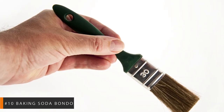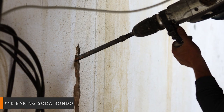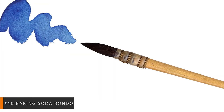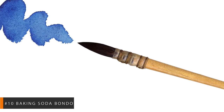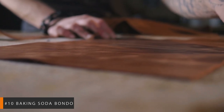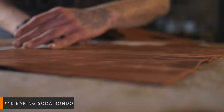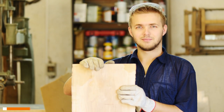You'll most likely toss the brush in the trash afterward. To make the magic happen, first identify where you need to fix or fill, then clean any dust off the areas where you'll be applying the mixture. Next, apply a thin layer of baking soda with the brush, then glue over top of it. Alternate and repeat until you've achieved your desired results. Finally, let the filler set for an hour before you attempt to sand, file, or drill the layered compound. Once it's complete, you should have a rock-hard fix that should last a lifetime.